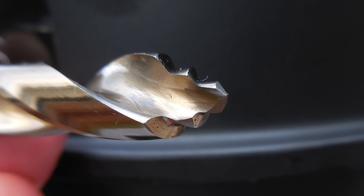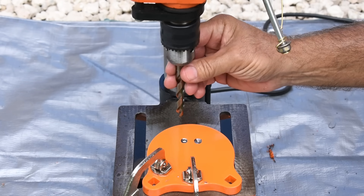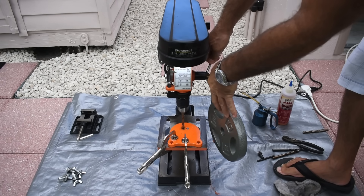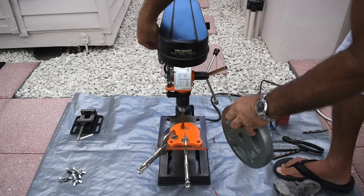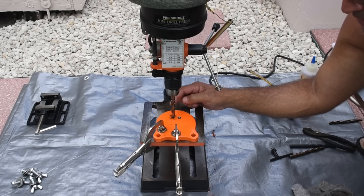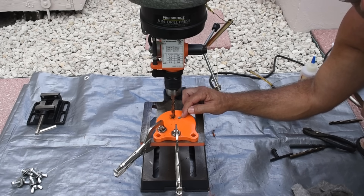Looking at DeWalt's Multi-Step bit, you can see the wear is minimal but apparently enough to stop it from drilling through the plate. I put it back in and applied more pressure manually to see if it made any difference — but putting more pressure is not going to help that bit drill through hardened steel. So far between the Milwaukee Red Helix and the DeWalt Multi-Step, the Multi-Step is doing better. They're both doing poorly, but the Multi-Step went far deeper than the Red Helix.